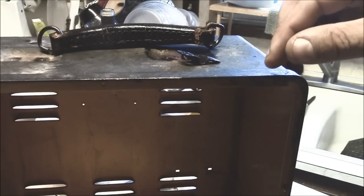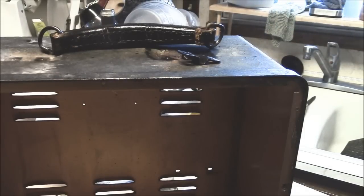There are a couple of little techniques to get small screws apart. One of the bad things about those little screws is their size — you can exert a lot of pressure on them and they're easily damaged; they were never designed to put up with that much force. Kind of take it easy. Make sure you've got well-fitting tools. Don't be afraid to soak things and let them sit. Don't be afraid to warm things up or heat them — you could heat that with a soldering iron, that's another good trick. There are a few little tips for busting some very small screws. Take it easy, and have a great day.